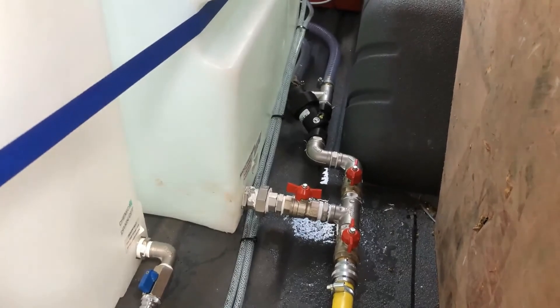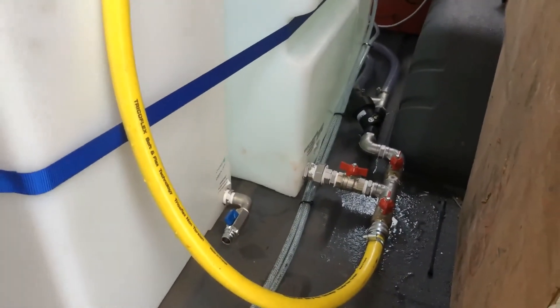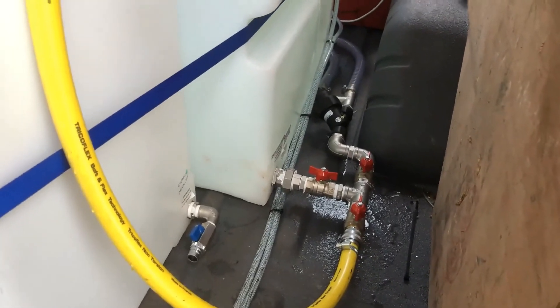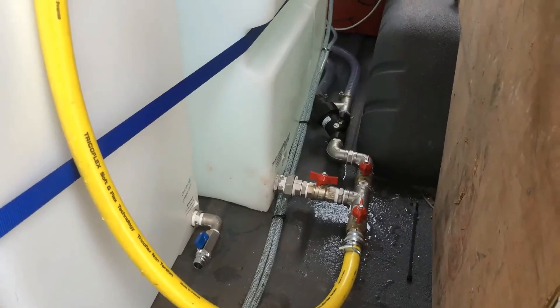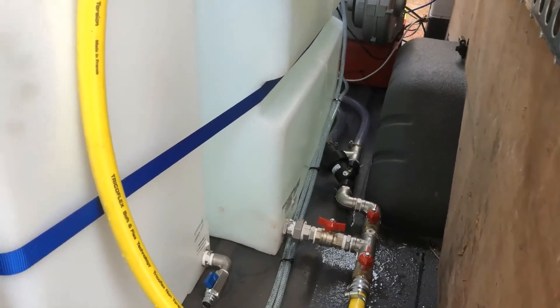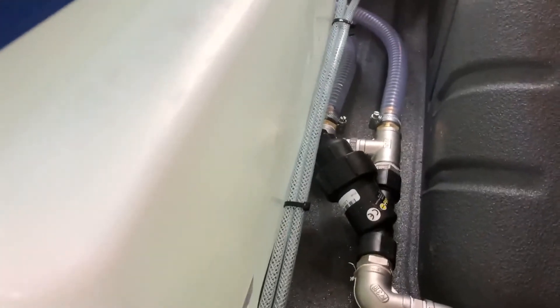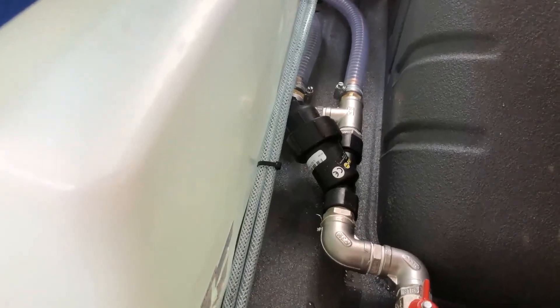Now when you're using it that way, always remember to keep an eye on your water level. If you don't, what can simply happen is you're running short of water, the machine will start vibrating erratically — you'll get back, pull the trigger and it's working again. Because what you're doing is this machine has been force fed at that stage. Always check what level of water you've got in the system itself. You've got the filter on that side there for protection, so make sure that's clean at all times, especially when you're using hydrant points.